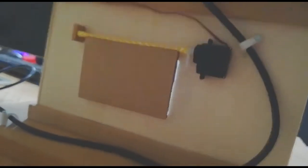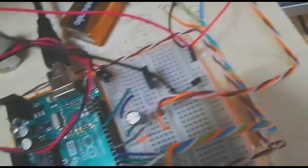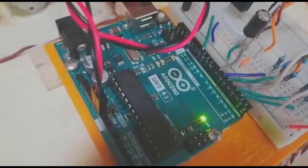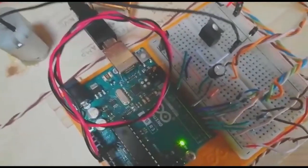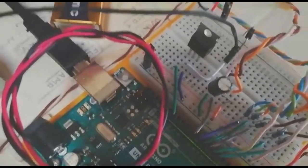For the blind, it is actually a servo motor. It is wired over here — this is the USB cable for the Arduino — and it comes over here where the data line is connected to pin 7 on the Arduino. We also have a capacitor wired to the ground and to the 5 volts.